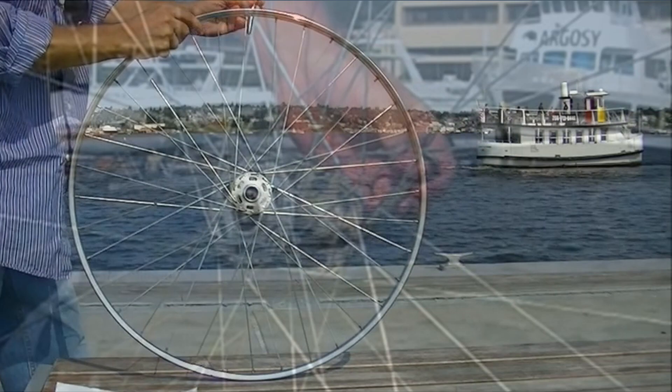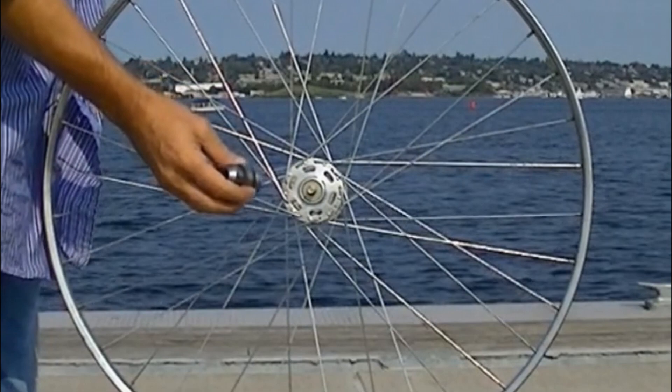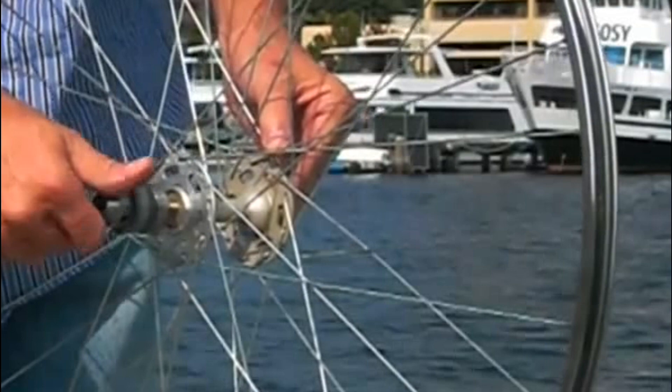It's important that the bolt be centered well. There's no need for pricey couplers or bearing mounts. Here's the secret sauce: a chuck from a drill as a coupler, solving a lot of problems. The chuck is adjustable, of course, and you can easily experiment around with different generators.